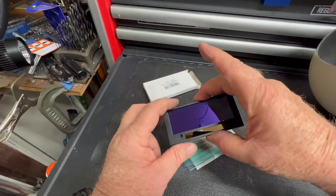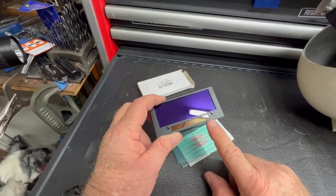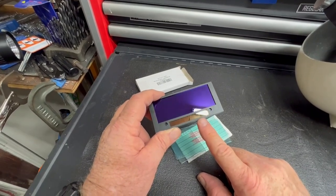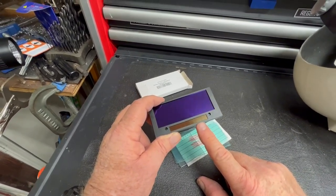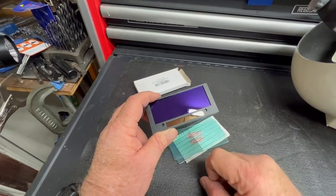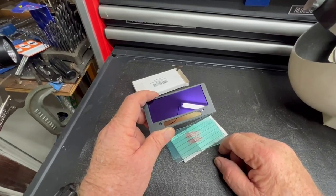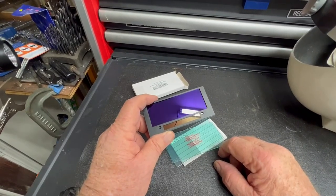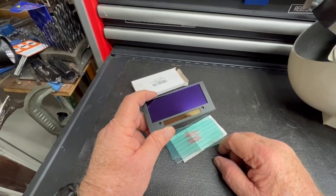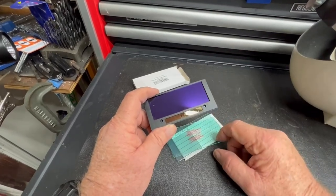This is the side that you put out. It has a photoelectric cell and actually powers itself off of the weld energy, and these little eyes detect when you start to weld and it instantly drops down from 3 to 11. These are good for grinding too, but just remember if you hit a lot of sparks it will start to darken and you might not be able to see.